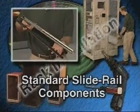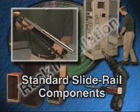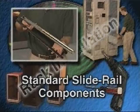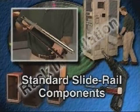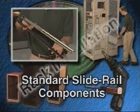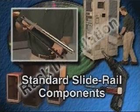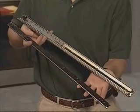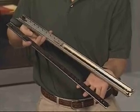We'll now demonstrate standard slide rail installation procedures. The standard slide-mounted components include most Compaq servers and professional workstations, ProLiant storage systems, and keyboards. Although we'll demonstrate installation of a professional workstation, all standard slide rail components use the same methods as will be shown. Retrieve two of the mounting brackets from the rack hardware materials.